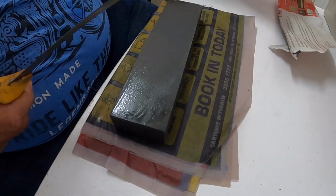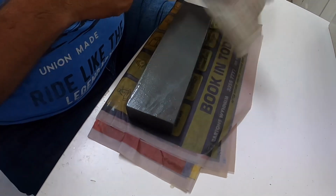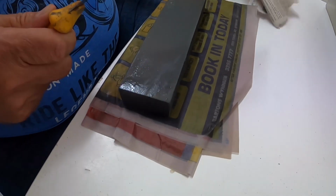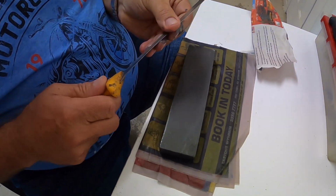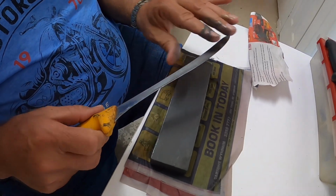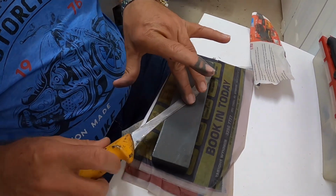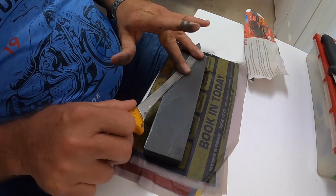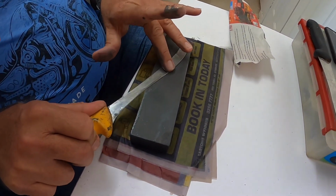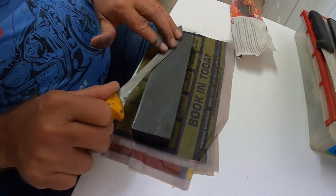You're basically keeping it off the stone at only a few degrees, maybe, I don't know, 11, 15 degrees or something like that. Yeah, mate, it's basically keeping that edge, because these are flat blades, and it's just keeping it so that the front of that blade has to touch that edge. And because these had, like I said, a poor man's edge on it, it's got a little bit of shoulder, so it takes that little bit extra to bring it back to the centre line.